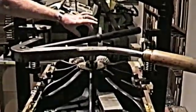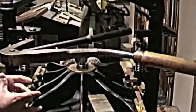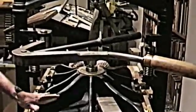The bar, instead of being attached to the side of the frame, was directly attached to the screw, so that when the bar was pulled, the screw would turn inside of that nut and descend ever so slightly, forcing the platen against the type. Then the whole mechanism was rolled or pulled out again, the tympan and frisket frame opened, and a printed sheet would come off.